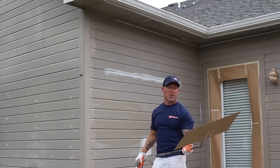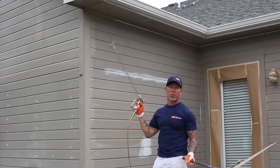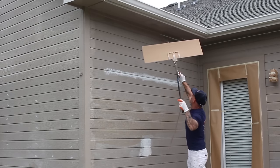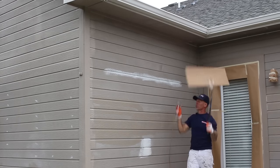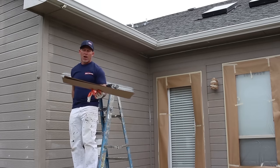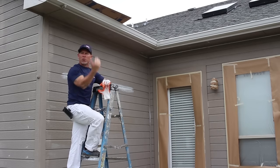When the cardboard shields start to get too much paint on them, I just set them aside, let them dry, and grab another one — they're completely reusable. We use them house after house until they get so heavy with dried paint that we repurpose them as gutter shields. When painting gutters, we stack the heavier old shields up in the gutters to keep overspray off the roof. I do have separate videos showing how to spray gutters and control overspray on the roof, but that's the basic method right there.